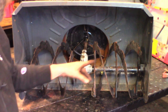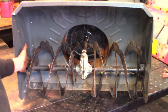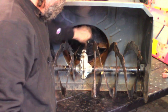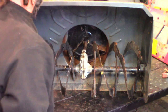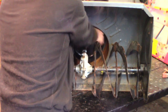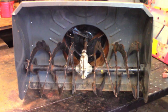This doesn't have bearings in the ends of the auger bar - it's just a plastic bushing that rides on the outside of this pipe. So I just cleaned all the rust off and put some grease in there. If I take the slack in the belt, that actually rotates nice and free. Beautiful - no screeching growling noise. Front end is done, finally.